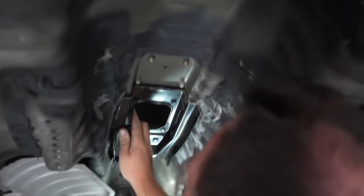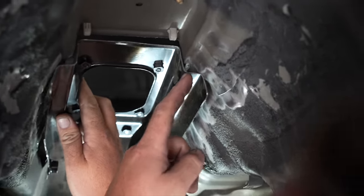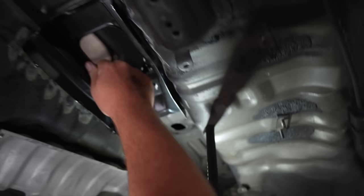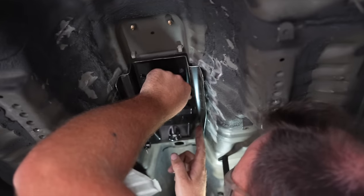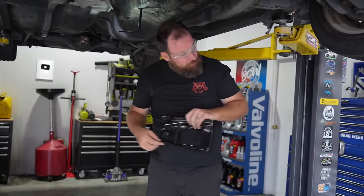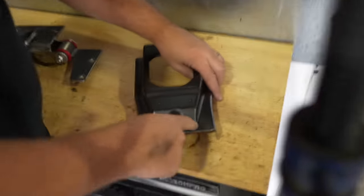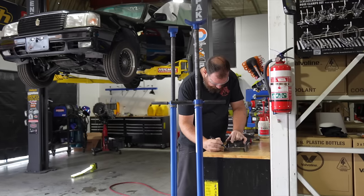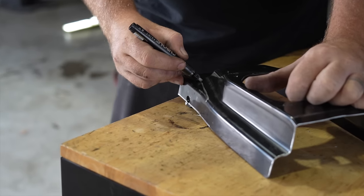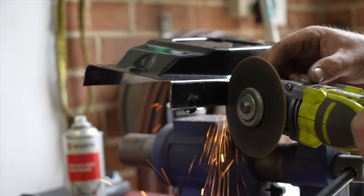From this angle that looks pretty good. See how it's a bit wide here? I think what I'm going to do is just cut down there. And for the back section, I'll basically just cut along and get rid of this flat. Because at this point we're going to be welding around here on the top side, so it's not going to be welded on the side in there. But that looks pretty good. Some freehand — should be all right. That's extremely straight lines for freehand. Thank you.